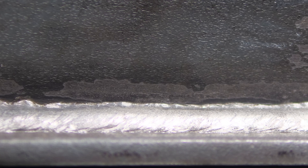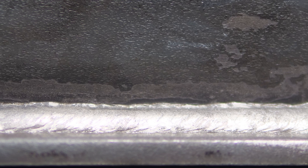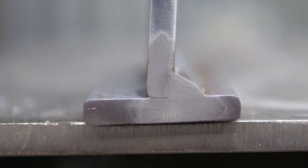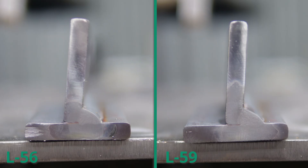Here's the L59's face, and immediately I can tell we've got a flatter face of the weld — it's not as convex as the L56. They were done with the exact same procedures, the same wire diameter, everything was held the same between the two wires, the travel speed and all that. The wetting action at the toes is absolutely fantastic with the L59. You can tell that the L59 just handled that mill scale and oxides a lot better than the L56 did. The real surprise for me with the L59 is the penetration profile — we can see that the penetration profile is a lot more rounded and a lot more consistent throughout the whole nugget of the weld.